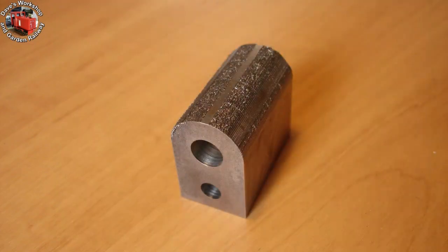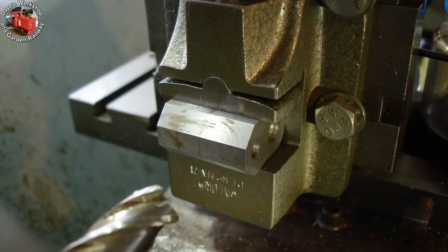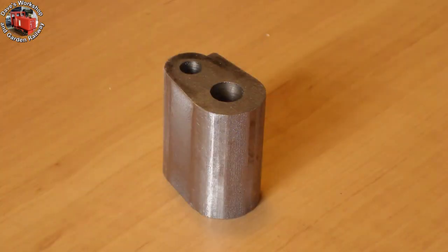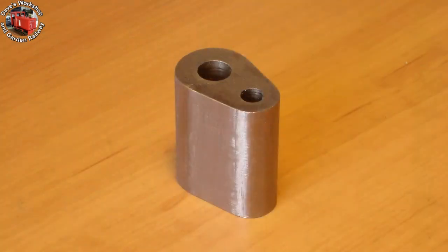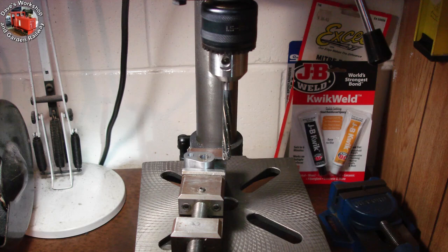The finished machined radius, ready for smoothing off by filing. Starting on a small radius. Small radius machined — I stopped 13 degrees short of the full 180 degrees so that the flanks blend properly. First flank fly cut. Profile complete and smoothed.